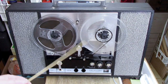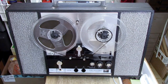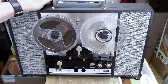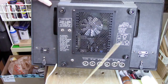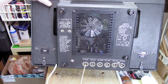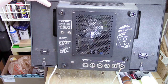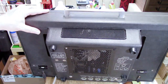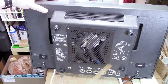So that's the tape recorder and how it all works. We have a three-digit counter with a thumb wheel reset, volume and tone controls. There's also a feature switch: when it's not on, Channel A is here and Channel B is here; when the switch is on, Channel A plays through both speakers. This grill has four screws — remove them and that's the tube complement. On the back we have outputs for each channel, high level input, preamp out, external speaker out for both channels, line in, and two storage compartments. There's also a grill for ventilation and a fan, so there's plenty of ventilation.